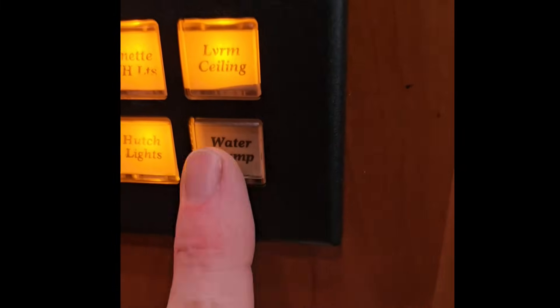Why wouldn't you want all of them to dim if it's just that simple? Well, sometimes we have a water pump — we don't want to dim the water pump. Often these buttons are used to turn aqua hots or hydronic heaters on, inverters on, or even visor control for the driver up front. All the dimmer does is lower the voltage on the DC side, so we don't want the shades to move slower or the water pump to work slower because that voltage is low.